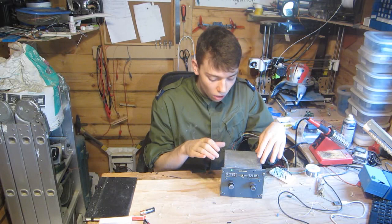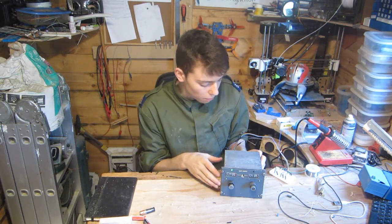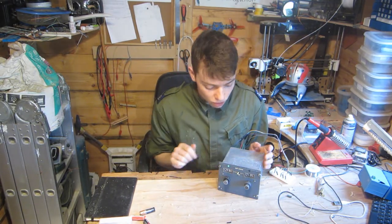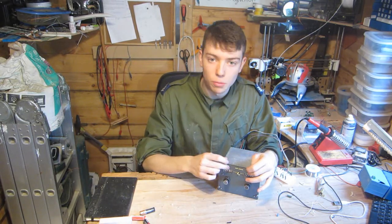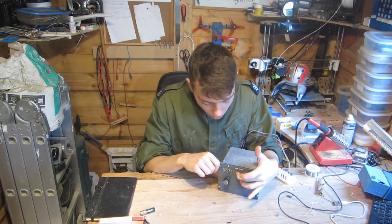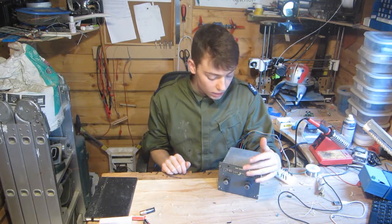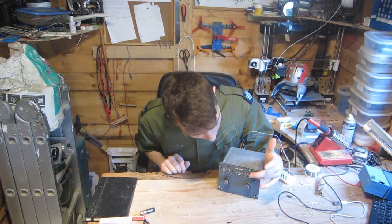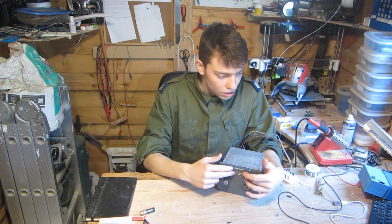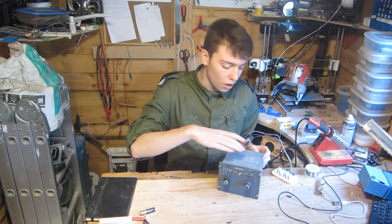Okay, so now all of the backlight has been rewired with LEDs to replace the bulbs where required. So we've got 3 different lighting systems in this radio unit. We have got these 2 bulb indicators which show which channel is selected active. We then have the text backlight, so this is LEDs, and this is again a separate system. And then finally we have the 2 dial illuminators, so they obviously illuminate the LEDs. So all of these are on separate channels.